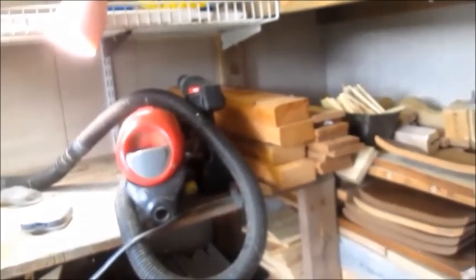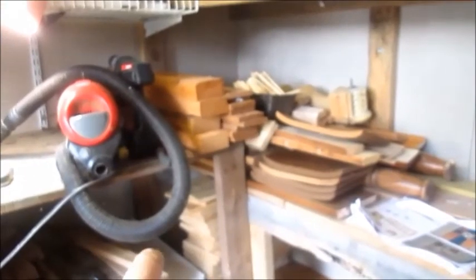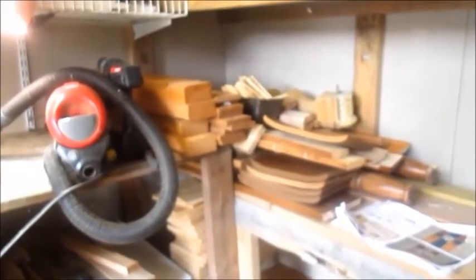And, well, I did pay for that cedar right there. That was 2x4s cedar, and I paid $7.99 a board. I got 2 boards, but then I split the boards into 2-foot sections, and then I resawed them into, I got 3 5/8 slats from each board, so that's quite a bit of cedar there that you can use, and it's kind of an inexpensive way to use cedar without paying extra for the premium stuff. I can plane that stuff out and it'll look just as good as the premium stuff.